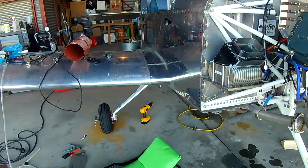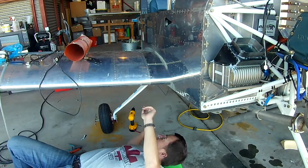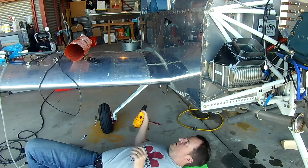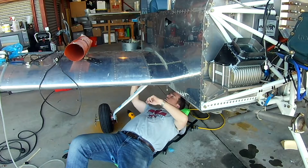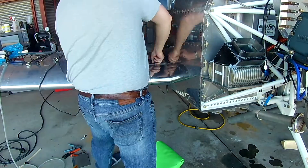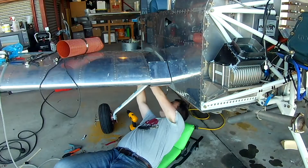What you see me working on here is just a piece of metal that you're going to deburr, drill, and dimple some holes. You'll see me match drilling and putting some nut plates in and flanges that never had any because it was waiting for you to form this piece of metal first. Once you do that, you've got your lower flange. Alright, let's talk about the training.